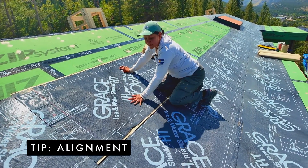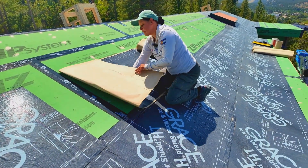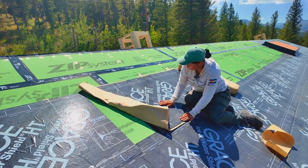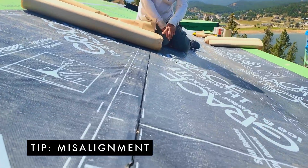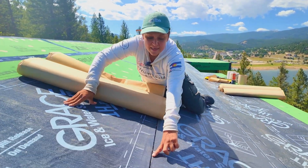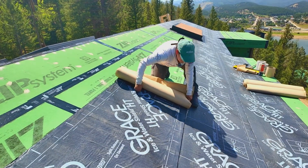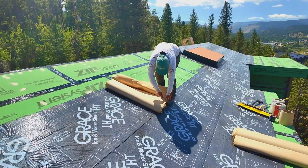Here is how this works: I already have my alignment — I'm a little bit off here on purpose because I'm going to align with the other roll over there. Once I'm happy with my alignment, I pull back to where I have that little piece of paper, remove it, and fix it to the roof. For misalignment: as you are rolling, especially with cut strips, they're going to start falling down — just push them every once in a while. If you identify that you're getting misaligned, and if it's not too hot, you can try to lift the membrane, realign, and continue. However, if you cannot lift it or you're off by half an inch or three-quarters, there's no way back — you need to cut the membrane and start a new strip.